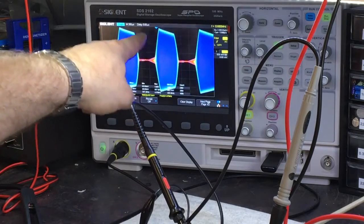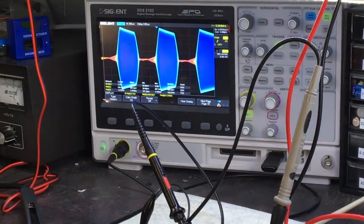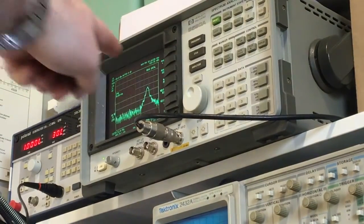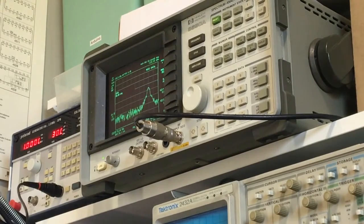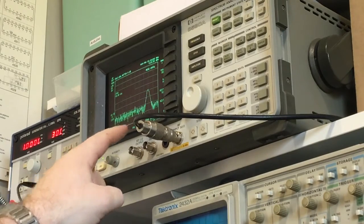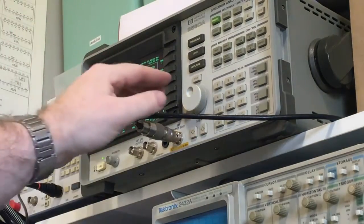Right, see how it's full flat here, flat here, flat here. Heaps of distortion, looks really ugly. And if you come up here and look at the spectrum analyzer at 54 megahertz, a lot more noise there, much broader, much worse. Turn it down, see that reduces, narrows down, right, all the way up, broader, narrow. Okay, that's on the 53 megahertz range.